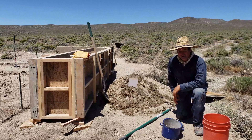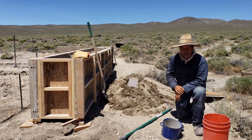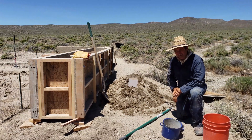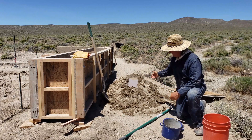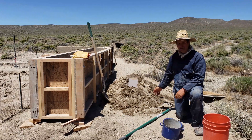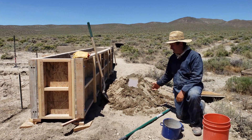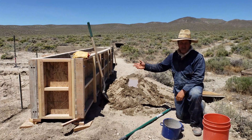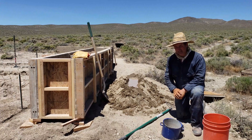I'm just getting ready to start another set. As you can see, I'm adding a lot of water to my dirt to get the moisture content up. The moisture content isn't high enough — the clay doesn't activate and it doesn't stick to the dirt. I've had to add about 15 gallons of water to five wheelbarrow loads worth of dirt in order to get to the right levels. I need about 20 to 25 wheelbarrow loads to fill one of these forms.